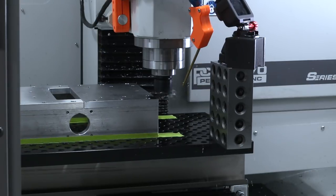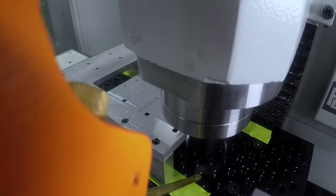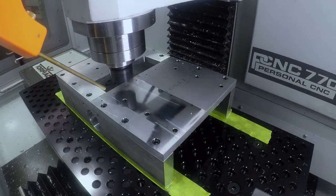I'm jog-feeding here. Pretty close to our standard superfly recipe — 2500 RPM, around 20 inches a minute — just trying to take off the minimum amount to clean up.